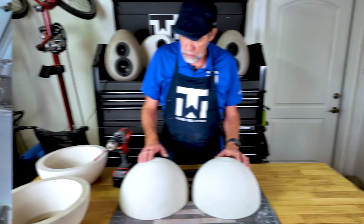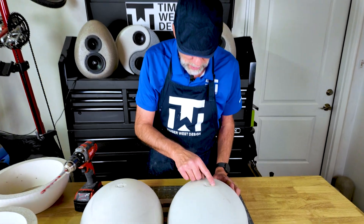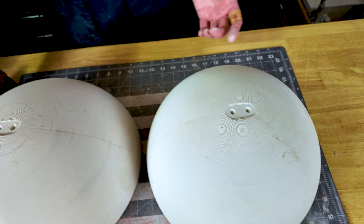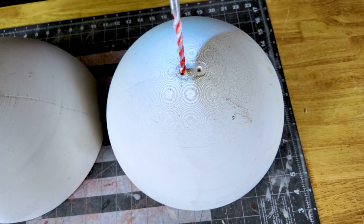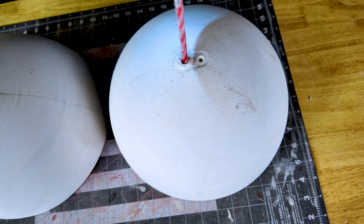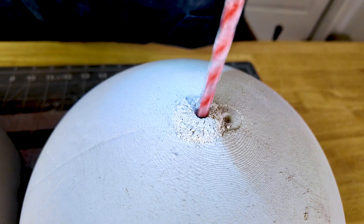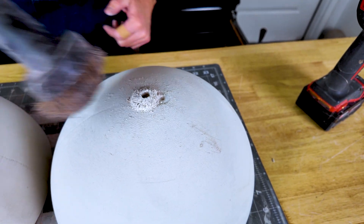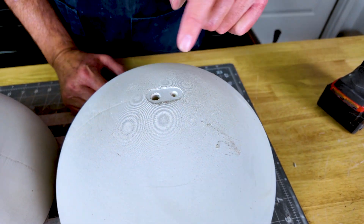Time for the next set. We're almost ready to glue, but there's one step I want to do first. I have this little flat spot molded in for the binding posts with two little indents as markers for drilling. So we're going to take a masonry bit, come in here with not too much pressure — just gentle — and this will come right through. Take the vacuum. And just like that, we've got a binding post hole.